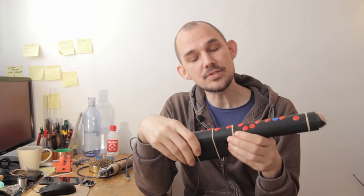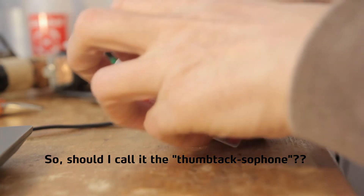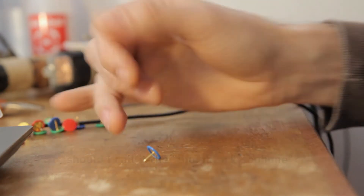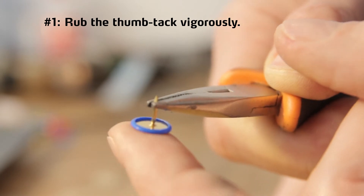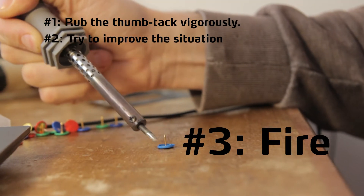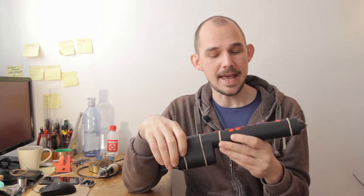The other new thing I wanted to try out was this concept here for the keys. These keys are actually made out of thumbtacks. The capacitive sensors that I use all consist of a metal electrode and a plastic layer which covers it. So these plastified thumbtacks seemed like an obvious, perfect solution for that — but they're actually not. The keys on here right now are an example of that. The plastic on these specific ones sits quite loose on the metal, which gives unstable readings. I tried a few things to improve the situation. I heated them to the point that the plastic deformed and separated from the metal, and then reapplied them with glue to keep them in place. As you can see, it didn't turn out perfect, and as the plastic is quite thick, the sensitivity of each key is also a little bit on the low side.